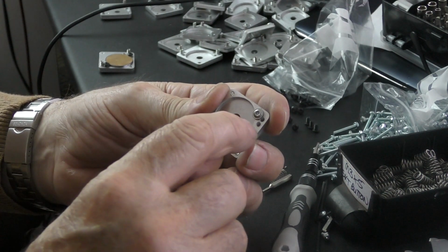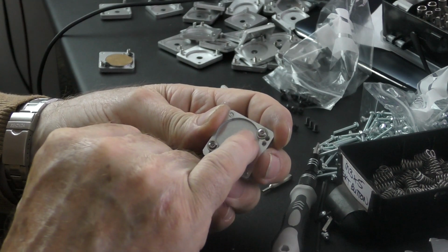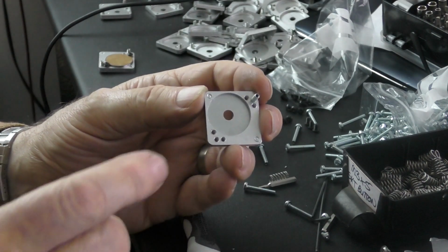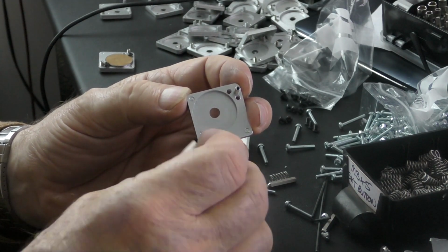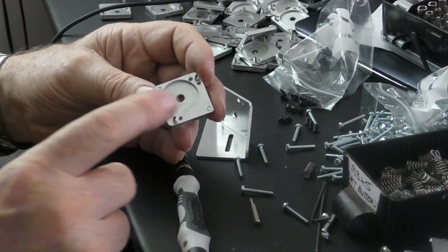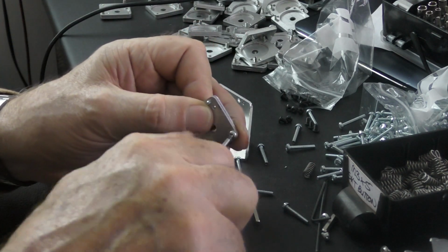The only problem is the closeness of these holes, there's a tendency for it to just overlap with the flange on this button head screw. So I've had to look at an alternative way of tackling this problem. The M3x10 grub screw goes in that top corner and this bottom corner. And we'll wind them through so that there's about 2 millimeters projecting through the other side here. Okay, now that we've got those 2 screws in, we can remove this corner screw. This is just the assembly screw.